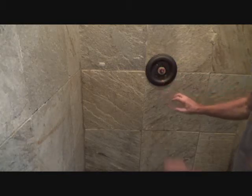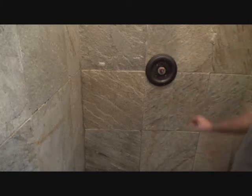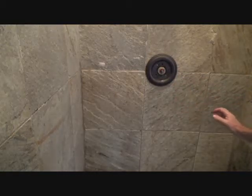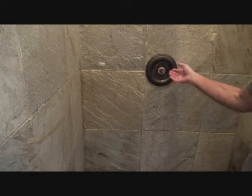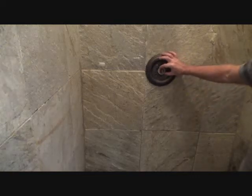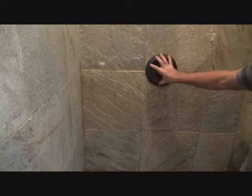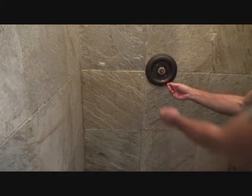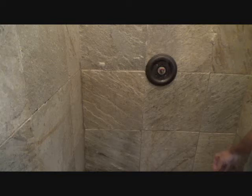I don't want to pull that off right now, get into it, and make a worse problem later. Know your limitations — don't start pulling stuff all the way apart if you're not sure what happens next, because you could spring a leak, you might not be able to get it back together. You might have to find the name of the brand of your shower valve so you can go to a plumbing store, because they're gonna ask you the model number and name brand.